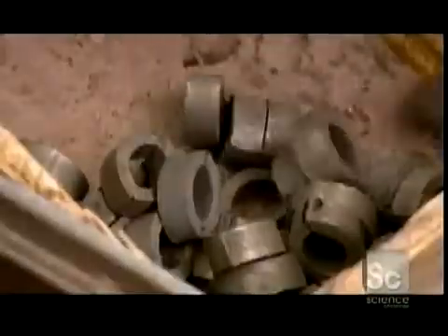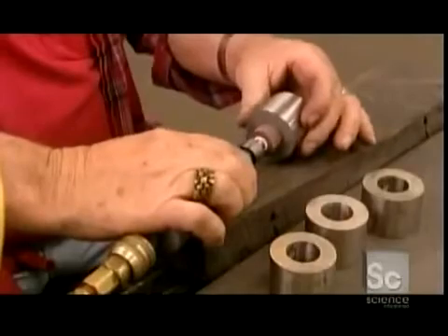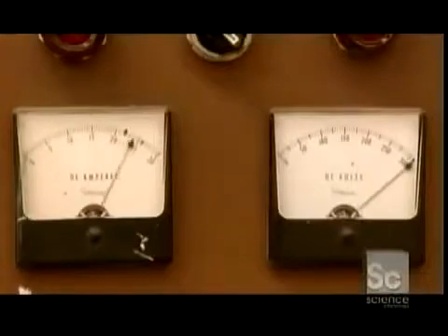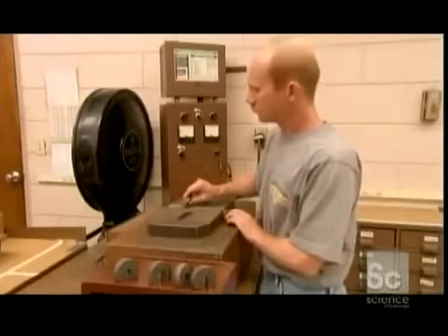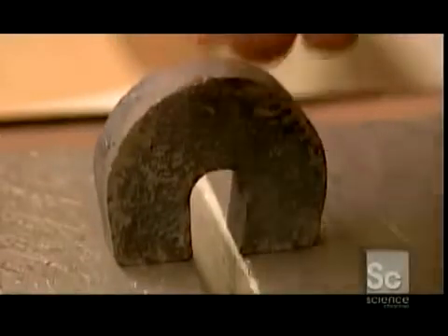Workers break open the seal. The process has left the rings mildly magnetized. Any rough edges are smoothed away. At this point the magnets are pretty useless, but this machine empowers them with a strong electromagnetic charge. The establishment of that weak magnetic field earlier ensures that the magnetization is now properly oriented.